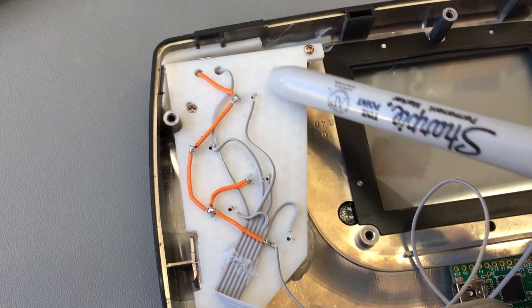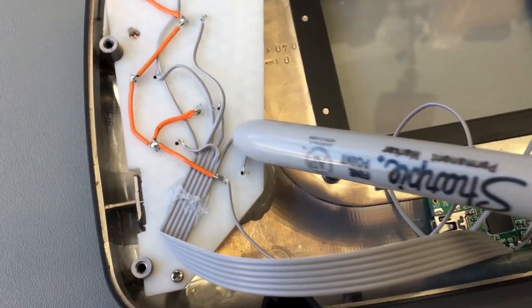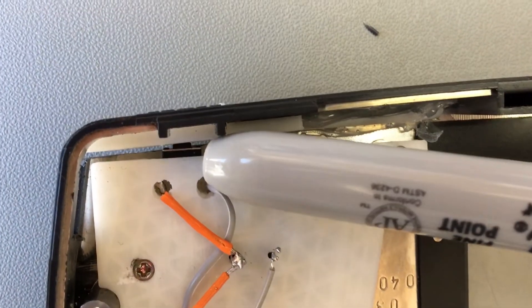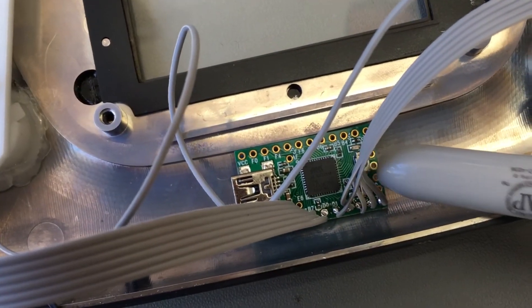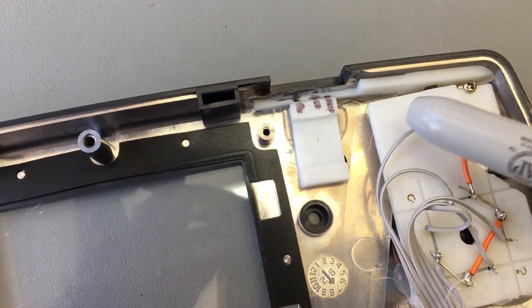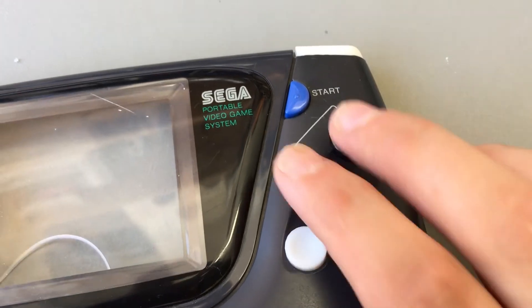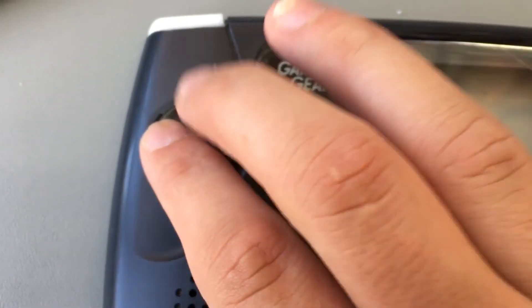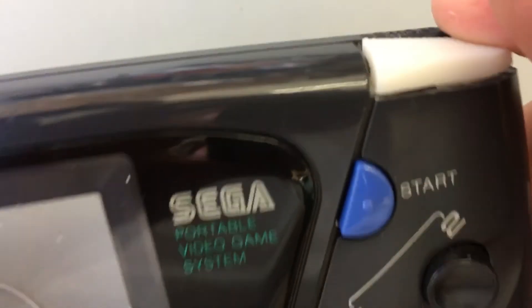So we'll do a tour of the inside of the Game Gear. This is the switch button plate and you can see the wiring here. Then we've got the D-pad plate, and at the top of the plate it's holding a micro switch going to the triggers — left and right triggers. Down at the bottom we've got the Teensy. There's the existing speaker that we're going to retain, and here's the USB plate with some registration marks. On the front we've got buttons one, two, three, four, and start. The micro switch gives nice clicky buttons, and those are the left and right triggers.